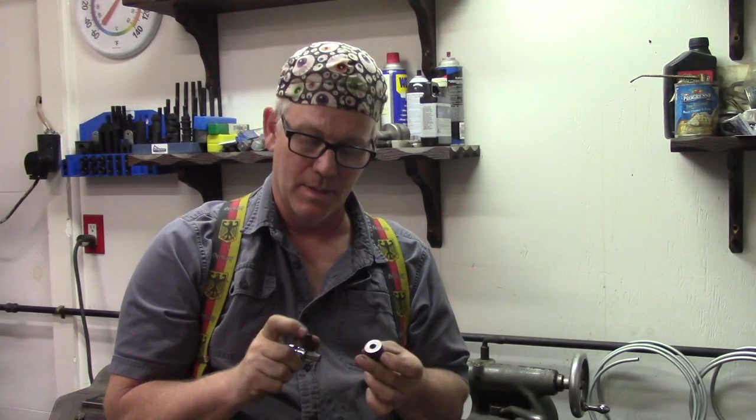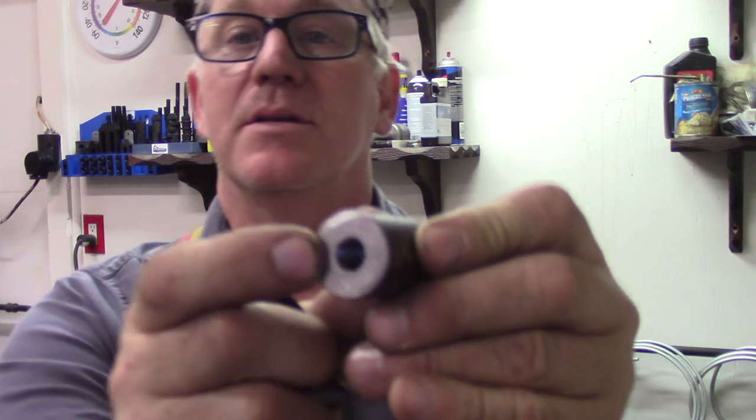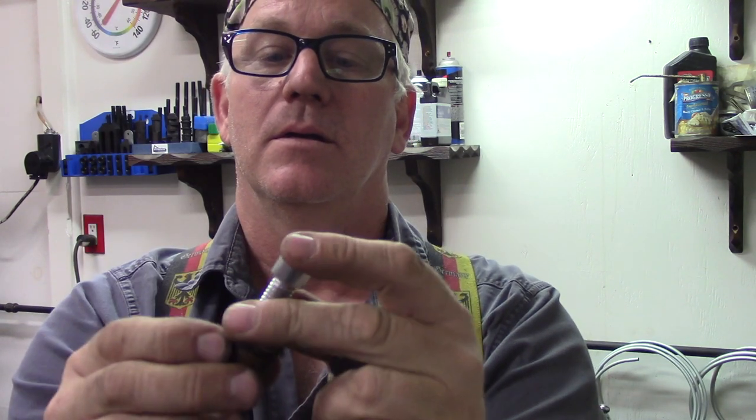This will be the basis for my top motor mount, and I'll explain what I've got here. This is 1-inch round stock. It actually used to be part of a tow bar for the tugs at JFK Airport. My brother would bring home the steel that he found laying about. And we almost dropped that. So I've got this drilled and tapped to 7/16 by 14. And you saw me counterbore this. Oh, there you are. And so what that does is I can put the Allen in here, and that'll hide the Allen when she's on the bike.